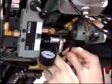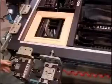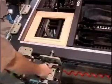You will need an adjustable wrench and an allen key to make this adjustment. In the manual pre-clamping setting, the four mobile jaws remain open even after shifting the lever to the second position. They will close in on your frame upon depressing the miter buttons, one by one or several at a time.